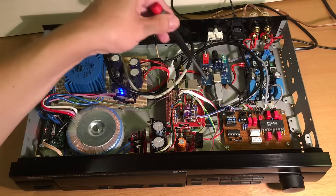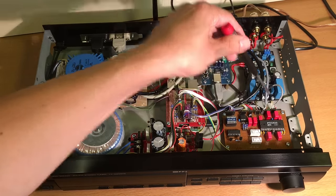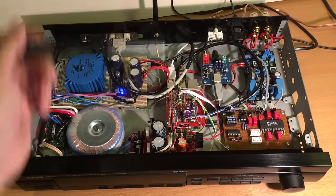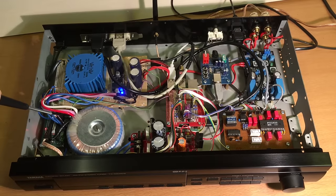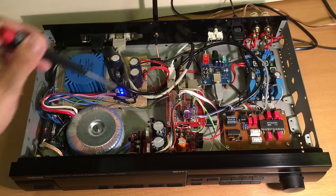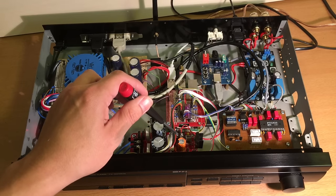What else do we have — here is just a USB sound card. The USB connector goes in here, and also into this sound board, and here you have two relays where you can switch between the Raspberry Pi, this module, and also the additional Aux in. Then there is the power control board — that is there to start and stop the device in a controlled way. It has two relays.